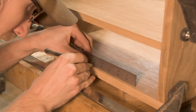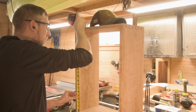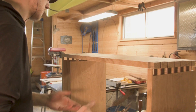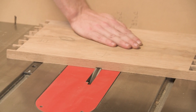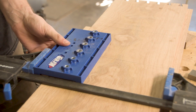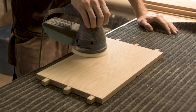With the bottom divider in, I can add the drawer dividers. Rather than one large drawer, I decided to cut a simple dado on the middle divider and bottom case piece to hold the divider and keep the drawers separated. The most important thing here was properly aligning the markings for where to cut the dado, because once the piece is taken apart there's no way to align things back to the same point. Also critical: make sure your dado is set to the size you actually want. Some dado stacks are designed for undersized plywood, so when the booklet says half an inch it'll actually be just slightly under half an inch.